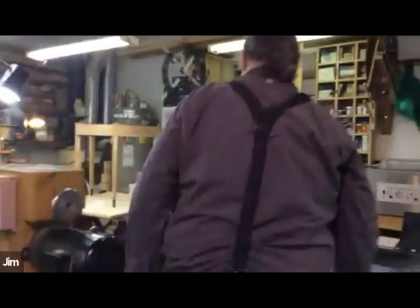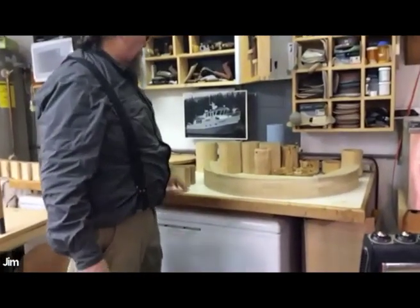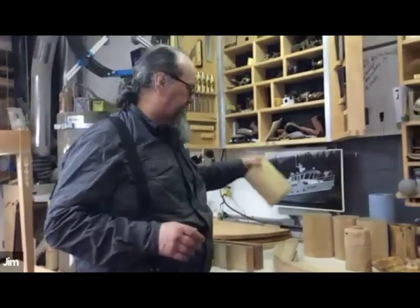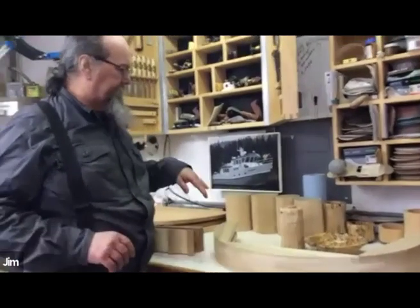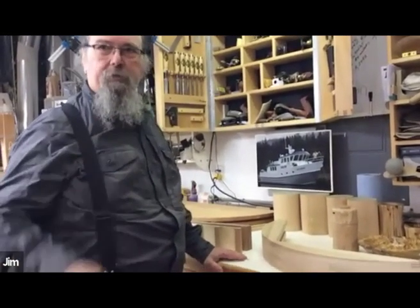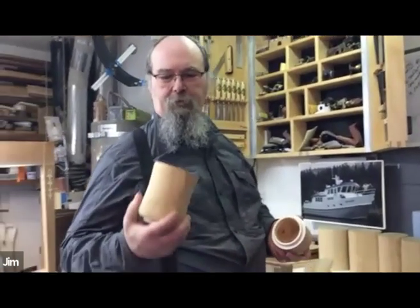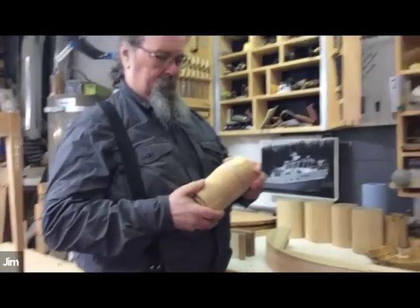What I do in my turning: I turn things green — they still have moisture in them — and then I paint them with a PVA solution, a vinyl acetate, so that everything dries really slowly. A lot of things I'll give a year to dry. Here's some spruce that Zach gave me — it's going to be guitar wood. This is a piece from my son's project where he was growing mushrooms on an alder stump, and this is the wood that came out of that project when he was done with the mushrooms.